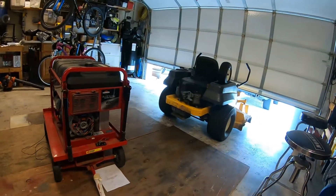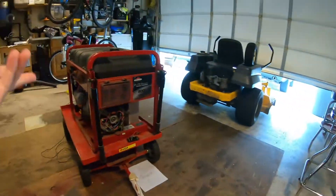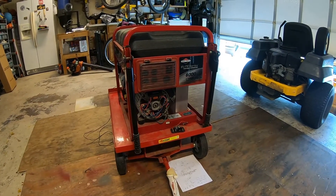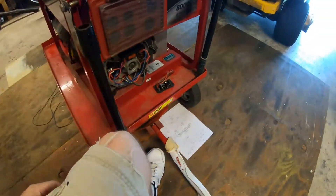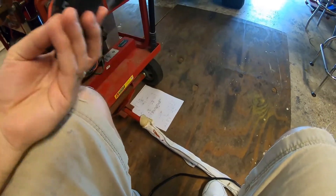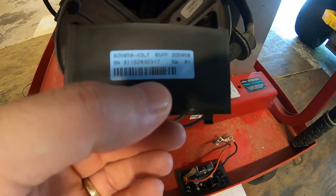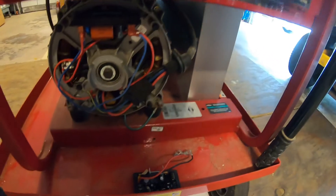So if your generator is not producing any power, or if the power curve when plugged into a scope looks kind of strange, you've checked the windings — the stator windings, the rotor windings — everything checks out: might want to go after that AVR. That was about $63 on walmart.com, got it in a couple of days. I don't know exactly what they changed, but you can see the PCB design is totally different, different components. This one actually has a software version stamped on it in the back. Not really sure who makes this — I doubt it's Briggs & Stratton — they probably buy it from somewhere else because they're not an electronics company.